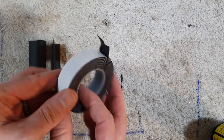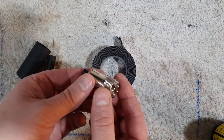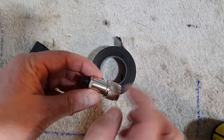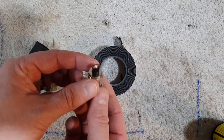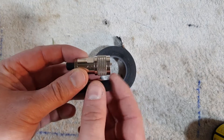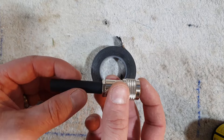Next, we've got self-amalgamating tape, and sometimes I use this in conjunction with these — glue-lined heat shrink. Now, here's a typical PL259. I only use compression fittings; the old type where you screw it in and put the solder, I don't like those. I always prefer the compression types. When I'm preparing coax lengths, sometimes I need to put a length of smaller diameter glue-lined heat shrink over the coax and build the diameter up somewhat — it just depends on the type of coax you're using.